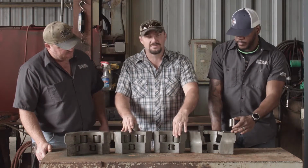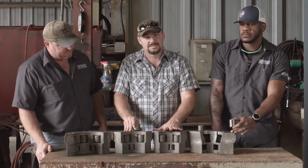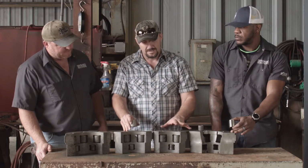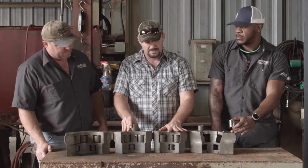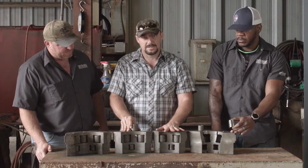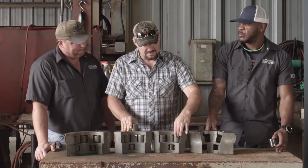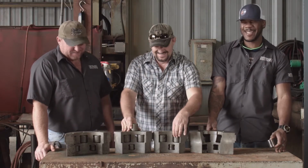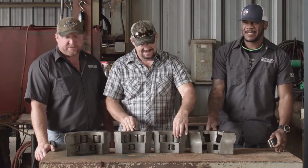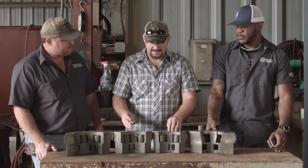The setup of these rollers can handle 6,000 pounds. We've done tests with these at 6,000 pounds, and we get around 40 pounds of torque on our elevator rotating it at 6,000 pounds. They've actually been accidentally pulled to 20,000 pounds and held well, no problem.